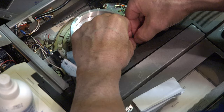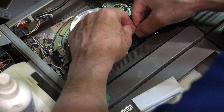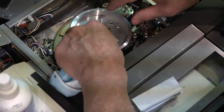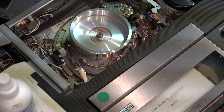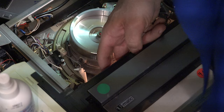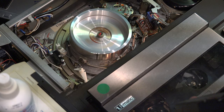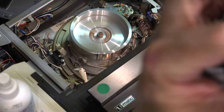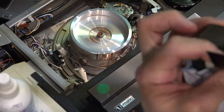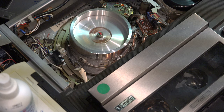Put your tape back carefully over the capstan — in this case just over the tensioning device. I'd suggest using a tape that's not good for this. Turn your machine back on and hit eject — the tape will come out. I actually did that wrong, so that's a good example: if you don't put the tape on correctly, it will come out and you'll have to wind it back up. Wind the tape back by pressing the button to open the top, and wind it back up so it's tight. Then you're good to go.